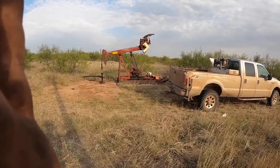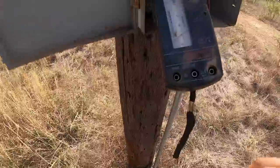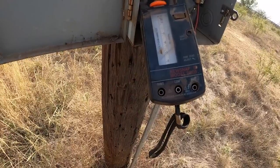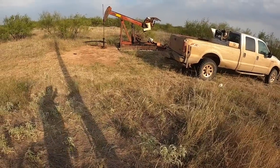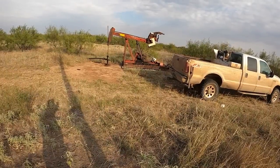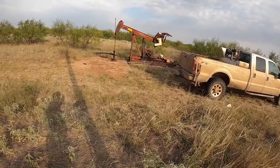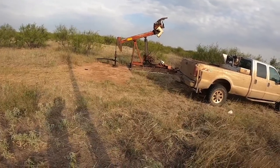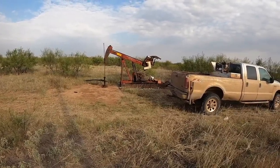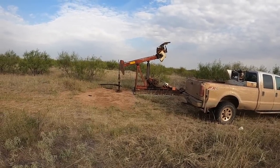It's been running a couple hours — it's 4:30. Look at the difference: we're pulling about 9 amps peak before; now it's just picking up like an extra amp or something on the upstroke, peaking about 6 amps. What a difference. Something that's more interesting — since it's not going so fast, when you shut it down it doesn't run back through itself. I swear I didn't add any weight to this thing. Without it pounding fluid and running slower, even if we shut it down mid-stroke, it just barely rolls through.